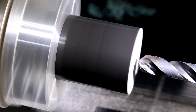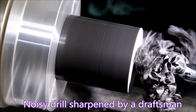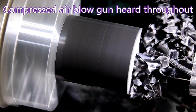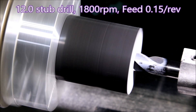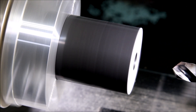This drill is perfectly on center vertically and horizontally. I can only assume that the noise it makes is because I sharpened it. From time to time you will hear puffs of the air gun trying to blow the swarf away from the cutting tool. I set up my Noga spray mister to run dry with maximum airflow and it worked quite well to keep the swarf away.